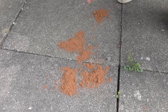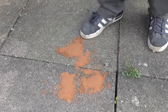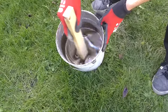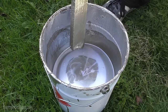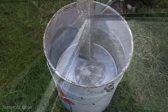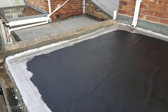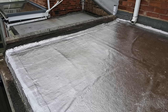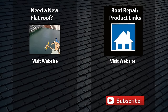Any small flicks of bitumen that find their way onto the floor can usually be dealt with by applying building sand generously to them and treading it in — let it absorb the bitumen for as long as possible and then just sweep it up. For a really nice finish and to protect your hard work for longer, consider applying solar reflective coating. This stuff also settles to the bottom and will need a good stir until the solids flow freely, then it's just a matter of cutting in around the edges with a two-inch paintbrush and applying the solar reflective coating with a cheap nine-inch roller, just as we did with the primer.